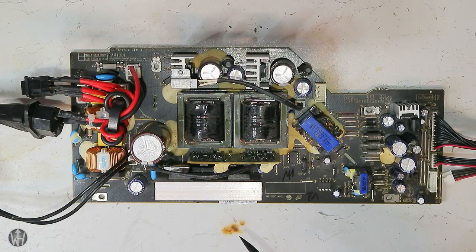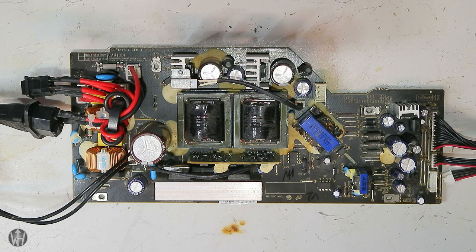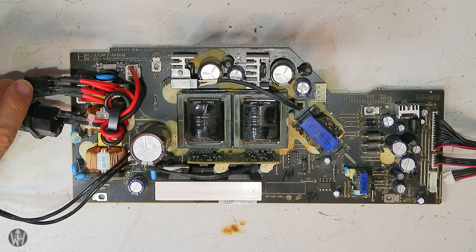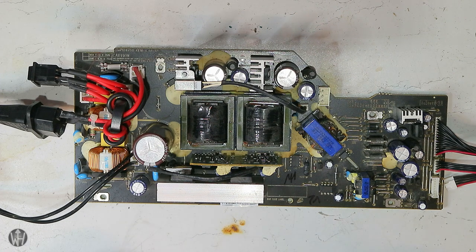So I will try to find a replacement with a higher voltage rating to make sure they won't experience that electrical stress again. I replaced the two bad capacitors, which had a value of 470 pF, and found similar parts — 470 pF — taken from an older power supply. Before I turn it on, it's attached to my isolation transformer. I replaced the internal fuse with a lower rating than the fuse in my isolation transformer, so if there is still an issue, this fuse will trip instead. Now, cross the fingers and turn it on. As you probably saw, this doesn't help.